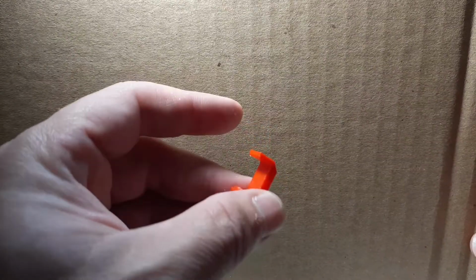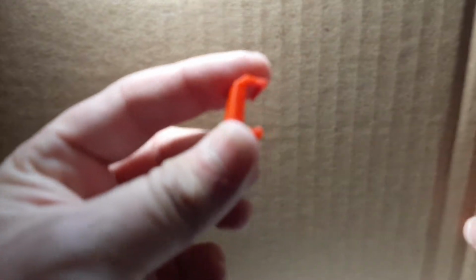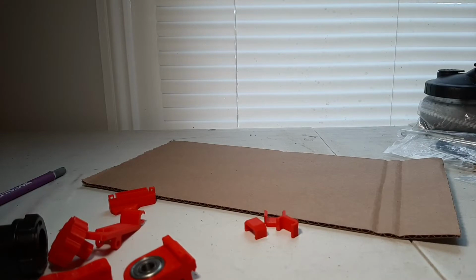They grab onto the ribbon cable for your display screen, and they snap onto the bottom extrusion and keep that cable in place, just so it doesn't somehow get tangled onto like the printing bed or something. As a computer builder, I'm really big into cable management, so I thought these clips were a great idea on how to cable manage that ribbon cable.